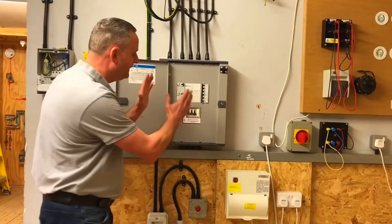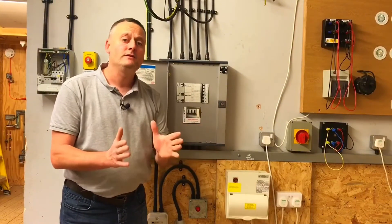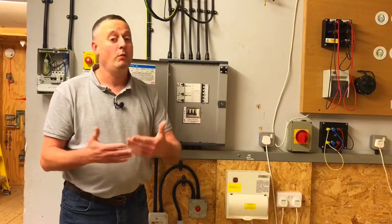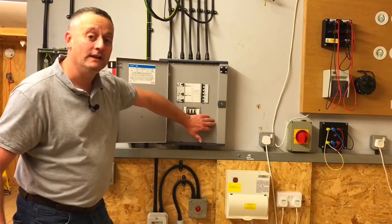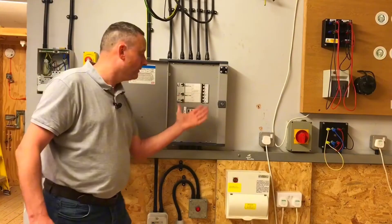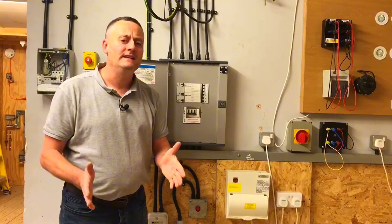When we do enter the electrical enclosure we are considering it to be isolated, but working in a manner that suggests that if it were live we're still working safely — especially when thinking about metallic enclosures being removed. Care still needs to be taken when removing the covers, but we're in a position where we think it's been isolated safely.